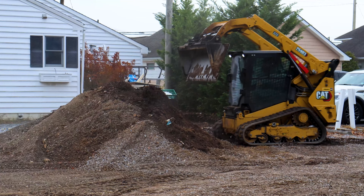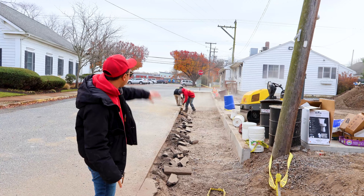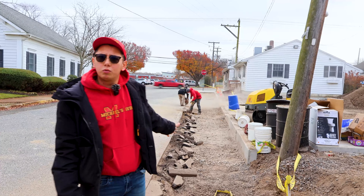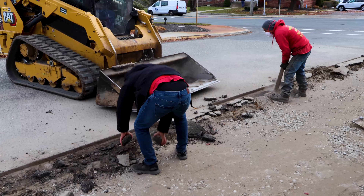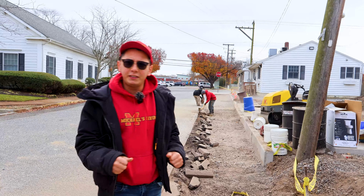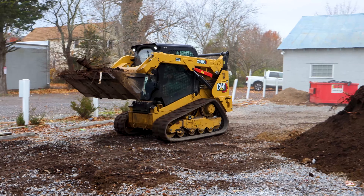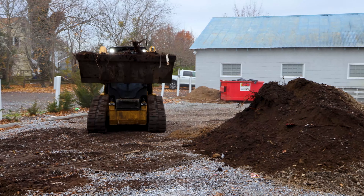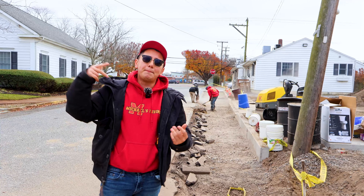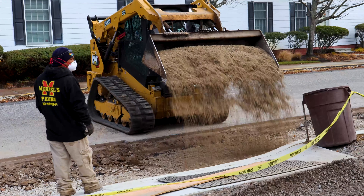On top of that we've got to dig out this parking lot — there are a lot of roots, which is a challenge. We've got to lay 10 inches of stone in what we're digging out here. For the road section we dug out about 12 inches of dirt, pulled out around 50 tons of material — just dirt mixed in with some stone.